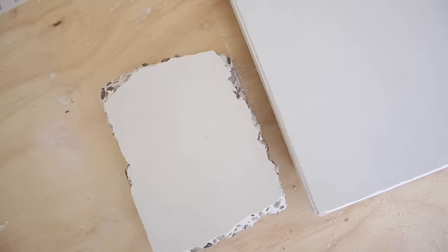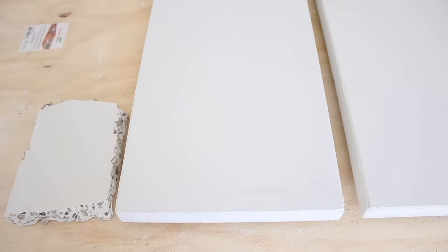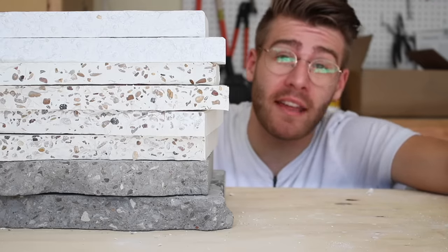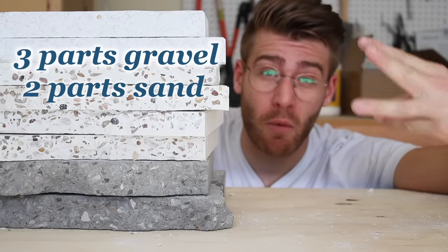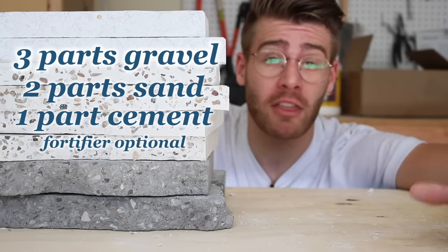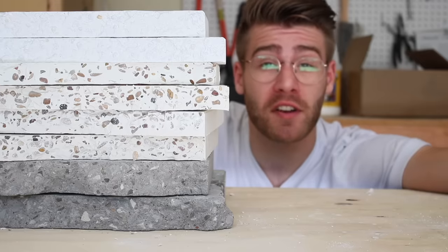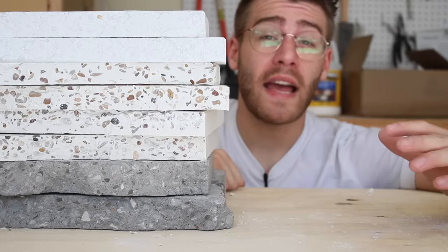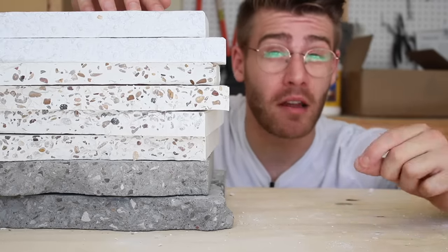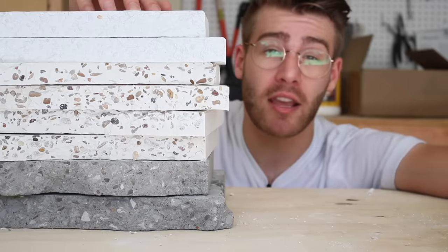You can see the difference in color — it's about a full shade off. The smaller piece is one of the first concrete pours, and the bigger piece is the ultra-white. So what did we learn? The best solid mix is three parts gravel, two parts sand, and one part cement. If you need extra strength, the concrete fortifier made a noticeable improvement, though it's probably not necessary — especially if you reinforce your concrete with rebar or fiberglass. One last note: the white aquarium rocks did not perform as strong as the pea gravel, likely because they were a bit brittle. There's a small trade-off: you get a whiter end result but sacrifice a little strength. Maybe just add some concrete fortifier.